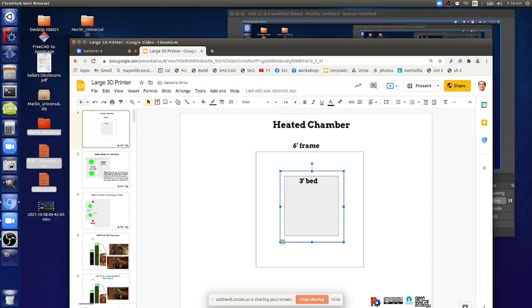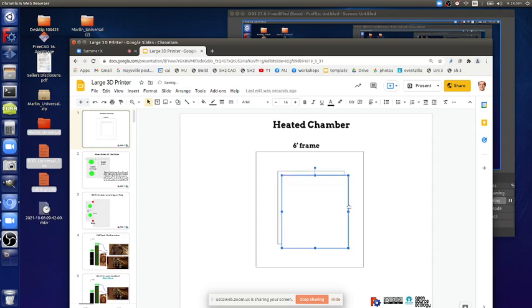And then the shroud, we need to leave a little bit of space around it. I would leave like 1 inch around the frame. Yeah, 1 or even 2 inches just to keep it safe. And then you're filling that with insulation, a few inches, like 4 or 5 inches, like the thick bats we could use. I would just use straight the thick bats we have. Yeah, just like 5 inches or something. So that heat chamber is pretty solid. So where does that get us now?